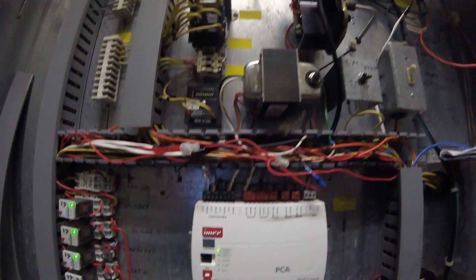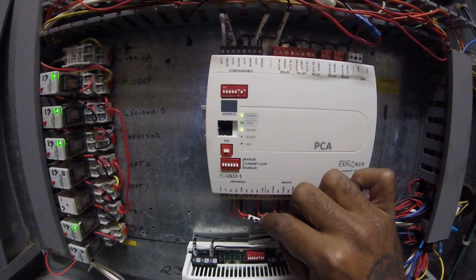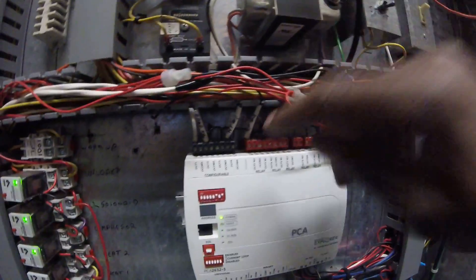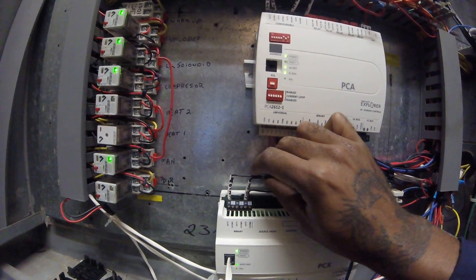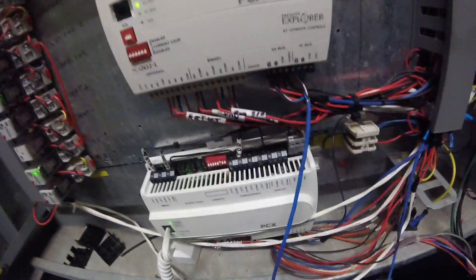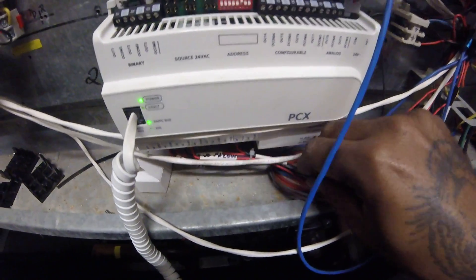Returning air temperature — these are binary outputs. These are reading a value like return air temperature. These are my heaters, these are my compressors, fan — these are relays. Solenoid, unloader. Looking for my low pressure switch — I think this low pressure switch right here.